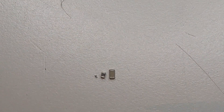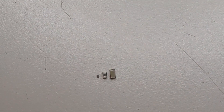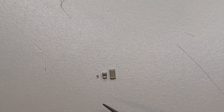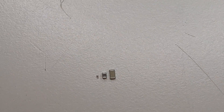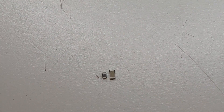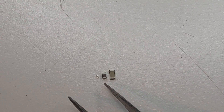Now let's talk about the small components we find on every design out there — normal capacitors. As you can see, we have different sizes, exactly like we found with resistors in the first episode, and the sizes are almost the same. They also have ratings like capacity, voltage, and so on. These types of capacitors, 99% of the time, are constructed from ceramics. They are multi-layered or just one or two layers — inside the ceramic we find multiple plates stacked on each other but not touching, to create more capacity.